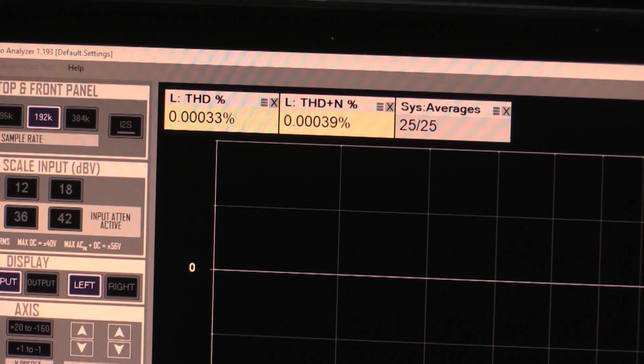Okay, after taking a look at both of my SG505 option ones, and letting this one warm up and bed in for a while as long as the other one to do proper measurements, let the frequency stabilize. One of the things the THD and the noise looked a little high was because there was some frequency jitter because it hadn't warmed up quite yet. We are much more frequency stable, which I will show here in a second.